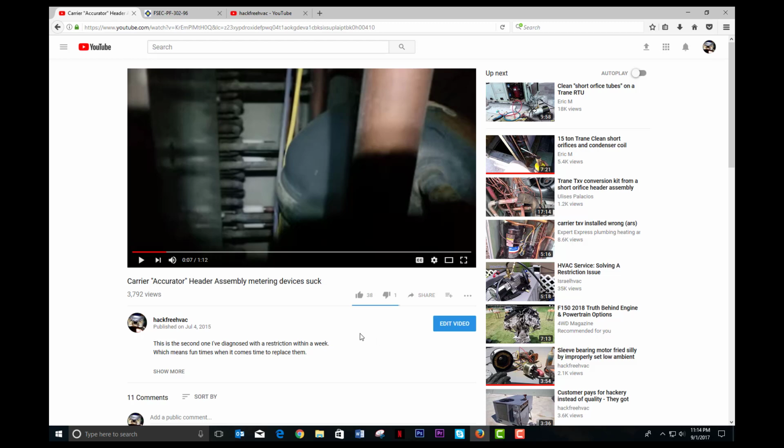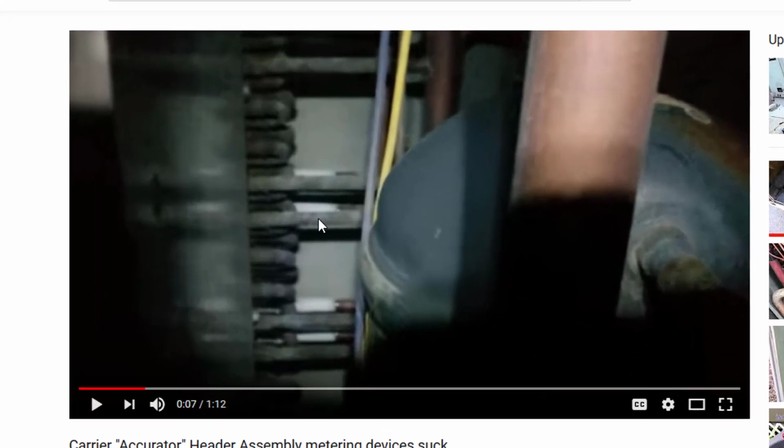What is up? On one of my videos from a few years ago, I showed how I went to a service call at night, and it had one of these carrier package units with the restricted accurators, they call them. Accurator is just their trade name, and Trane does it too. They have multiple orifices, one for each pass through the evaporator coil, trapped in between little crimped dimples on the copper line. You've got this header of all liquid coming from the condenser, and as it branches out to the parallel circuits, there's a piston, one for each circuit going into the evaporator, and then it comes back out and joins back to the suction.